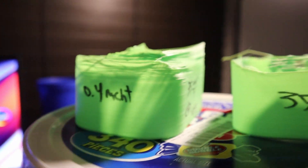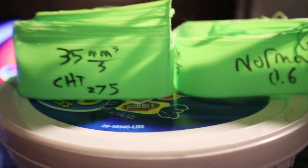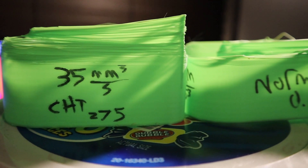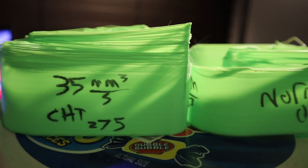The way I see it, there's no real advantage to using a CHT over a normal nozzle unless you're expecting under-extrusion. I don't really think CHTs are worth the money, especially for the $25 or $30 they charge. Full disclaimer that this wasn't super scientific, but it was my testing for whether CHTs work, and I didn't find them helpful for volcano hot ends.